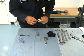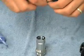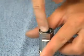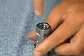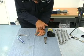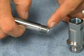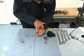Next, we have the o-ring that goes in this side. This o-ring doesn't do any sealing for us — it's just to hold the landing in there. If we're changing nozzles out over the cutting table, it holds the poppet in there so it doesn't fall into the water on you. Parker Lube is important on this o-ring. If we put it in dry, it has a tendency to hang up on the end of the nozzle body and roll up underneath where we need our sealing surface, and then it leaks. Make sure the o-ring is down in there.